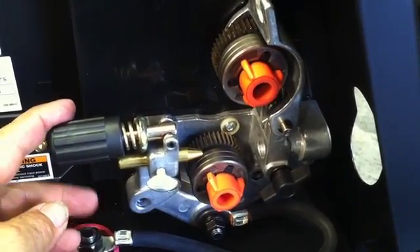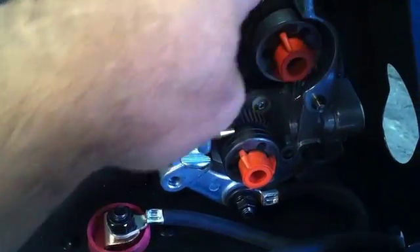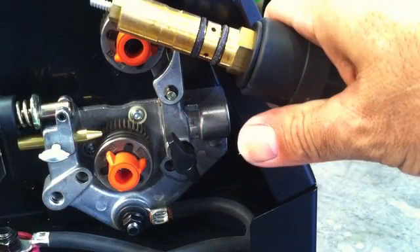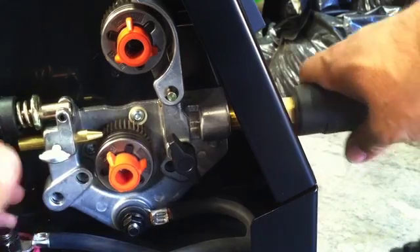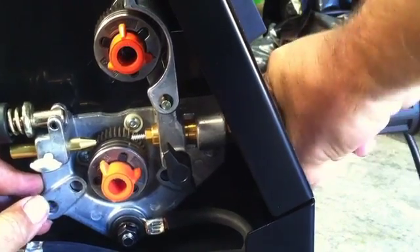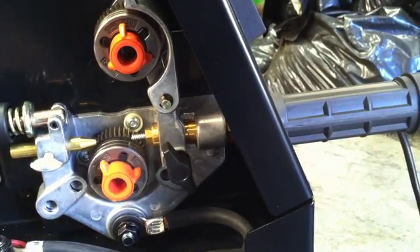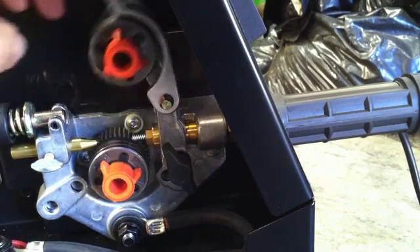Here's the drive roller mechanism — pretty heavy-duty little assembly, cast aluminum. I'm going to hook up the MIG gun now. You see this little double o-ring assembly with the ports in there. It's very important to get that thing seated, mashed all the way in there so those double o-rings seal off the argon or shielding gas port, so you get adequate shielding gas and no leaks.